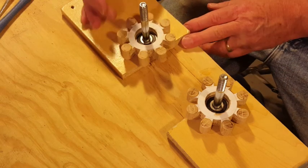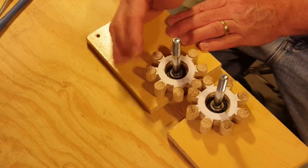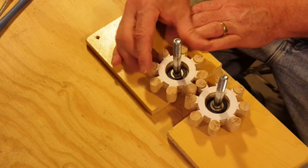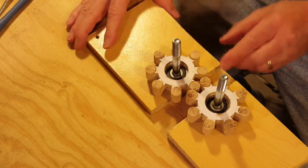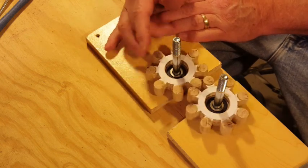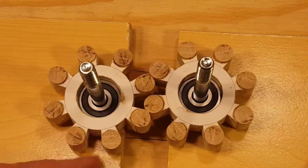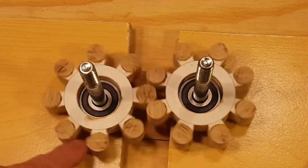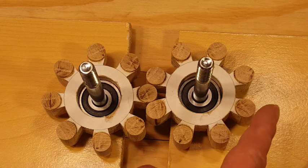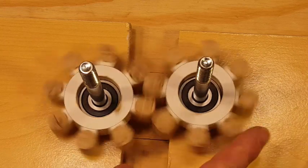Now for the test. You can see each gear spins pretty freely on the 10mm shafts. Here's what it looked like the first time I had the gears meshing. I tried pushing them closer together and you can see that some binds were created, so I separated them just a tiny little bit and it freed up both gears to spin. Here's another shot of the gears meshing — they're not perfect but they came out pretty well. Overall I'd say the second set of gears came out better than the first, so improvement has been made.